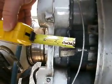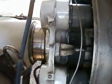This one here is a good example. This little one here is pretty worn down, and we're going to take a little measurement here to give you guys a reference. That's one and a quarter inch — one and a quarter. So right there, that one is wearing down pretty fast compared to the other ones. As we go along, we'll get to see that they wear — some of them wear evenly, some of them wear in unison — but nonetheless, that is the visual indicator that will let you know when it's time to change a brake on a heavy aircraft.